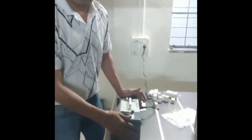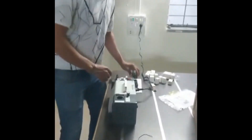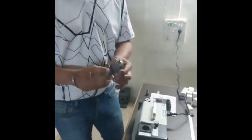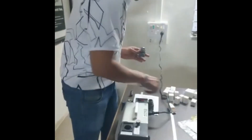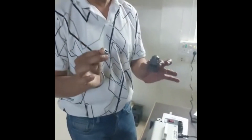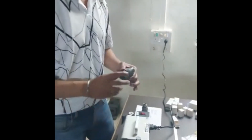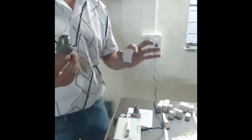This is a drill resharpening machine with capacity from diameter 2mm up to 20mm. For 2mm up to 13mm, we have a collet chuck housing ER20 collets. From 14mm up to 20mm, there are ER25 collets.